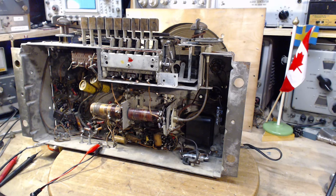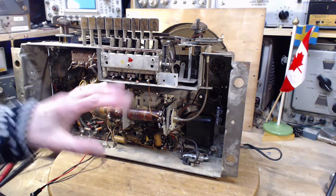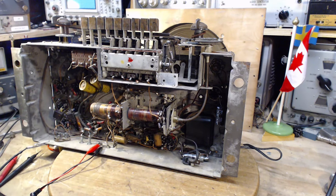What if I use a real wire wound resistor? Would the wire winding cause a problem? I don't think so. If anything, it's just more inductance. Considering the size of the field coil compared to a little bit of wire wrapped around a resistor, how can that be an issue? So then what wattage would I want to put on there? I had my hand on the speaker, I felt the heat and measured the temperature. It doesn't really help me know how many watts are going on in here.